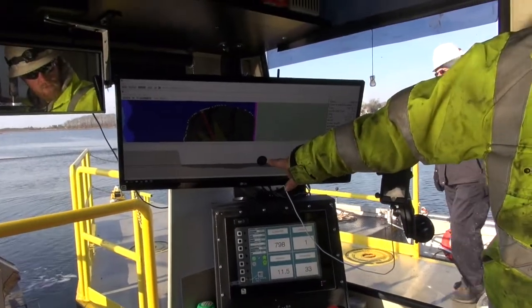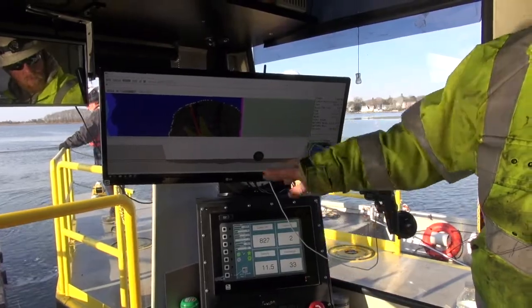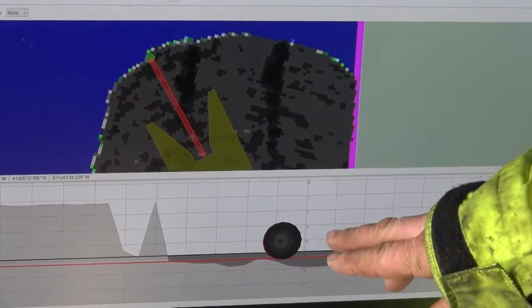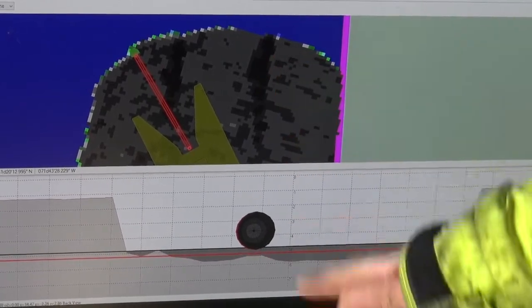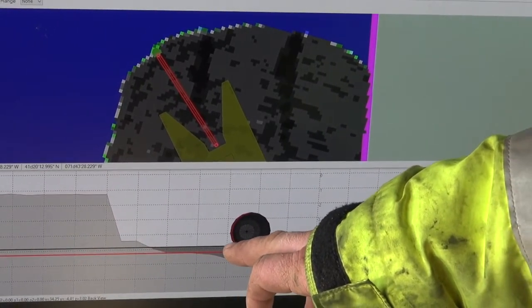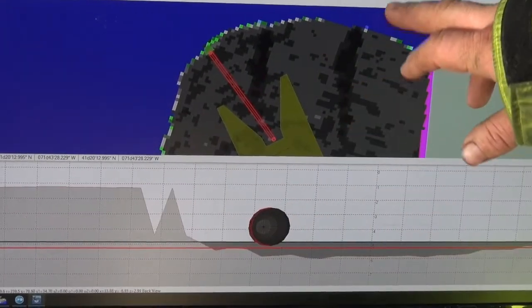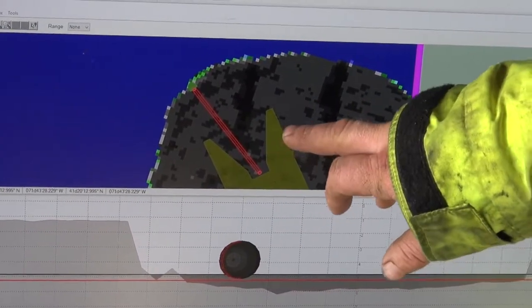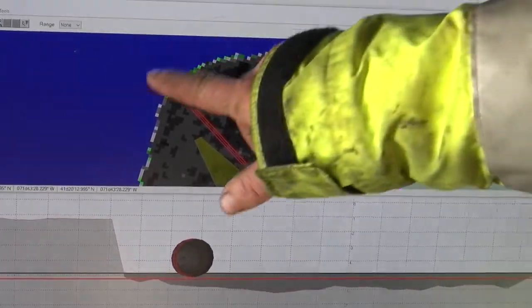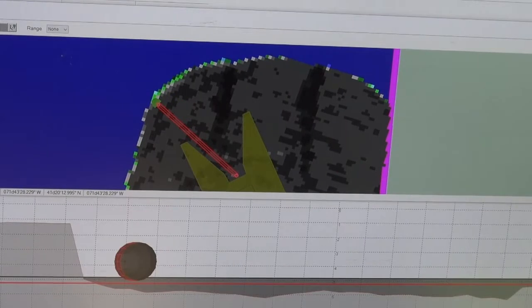Here you can see the computer monitors where that cutter head is at all times, and he keeps it at a certain level. So here is your cutter head, which is at the end of the ladder, cutting through the material. GPS is linked to that, and wherever he picks it up or down to, it'll move to that level. He follows a line, and that line is the grade we want the material to be after we're done. This is how much material is actually there, so as he cuts through it, it disappears. GPS is linked to the machine and when he sets it over, it'll follow him — it also tracks his progress. All this dark blue here is all material, and after he goes through it, it turns to a different color, so he knows he already went through that material.